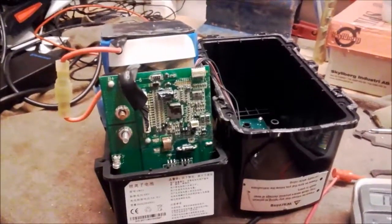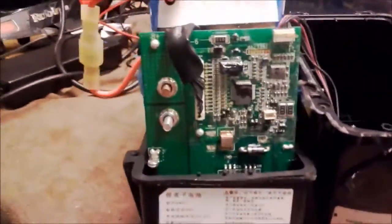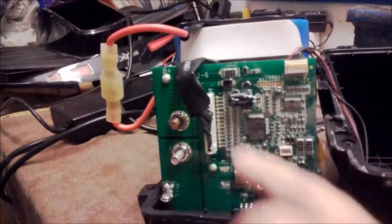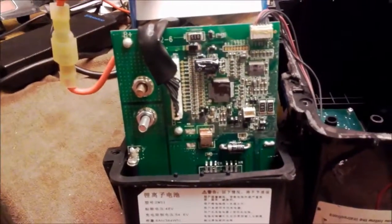To check the battery in a simple way, first check you have the same voltage from both sides — there's some kind of tilt fuse here. Then you can start measuring each test point from zero volts to battery voltage to test each cell and verify they are around 3.7 to 3.8 volts when fully or almost fully loaded. That seems to be correct.